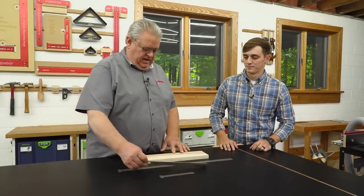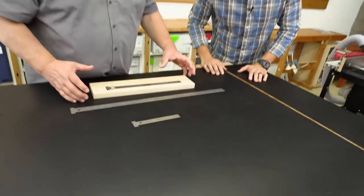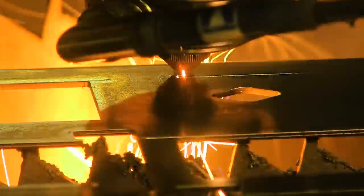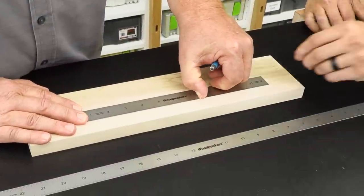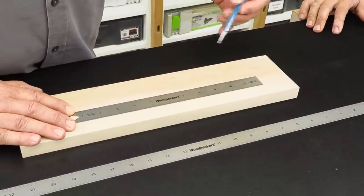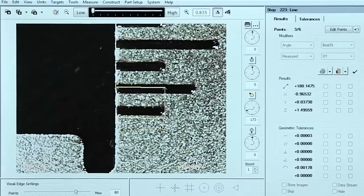Jay, when we make a tool like the hook rule, the cutting of these isn't stamped out — these are actually cut with a computer-controlled laser. Also very important, the graduations are not printed; those are laser engraved. You can actually feel that with your thumbnail — you can feel that it's below the surface, done with a very accurate laser system.